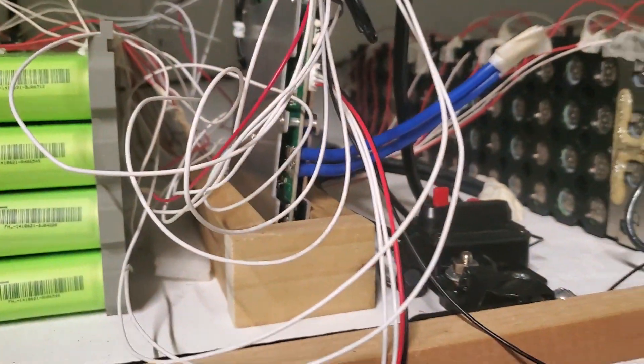The reason you don't see cells 4, 5, and 6 is because the negative wire is not plugged in. If it's plugged in you won't have a problem. The negative is not plugged in — that's why it's out of whack. But you can tell some of the cells are out of whack — this one is at 7.5V which is not supposed to be happening. I'm going to pause this video to do the wiring properly. Now I've made the negative touch the main negative. There's a wire for the main negative and it now touches the main bus negative. You see the battery is out of whack — 3.8 and 2.8, that's not good. I've got to discharge this battery.